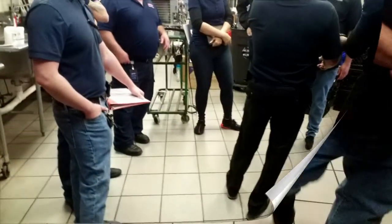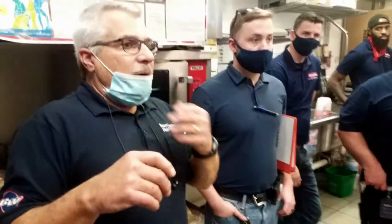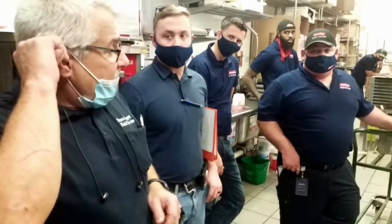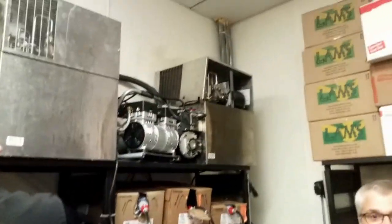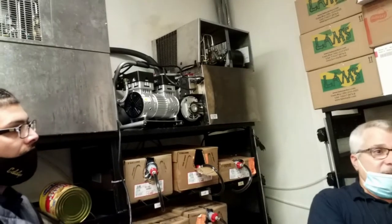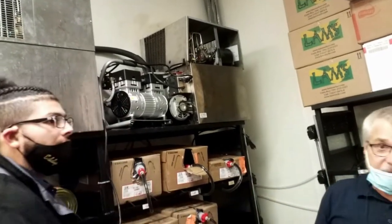And you see that split. That split is right. They are supposed to be replacing that tubing. We have a fountain reset coming up. I don't know what the details of it are, but the vent. Okay, it's on that tank. On the tank itself is a little valve. Anytime you're back there, put a cup under it, open it up, and that's going to drain the water out of that tank. That's going to keep the water from getting in the system and making the pumps fail.